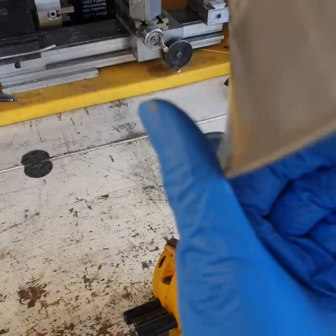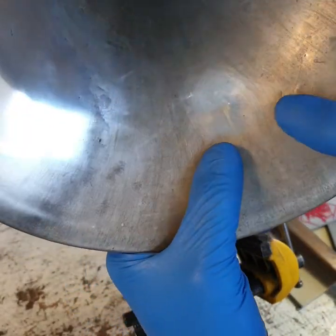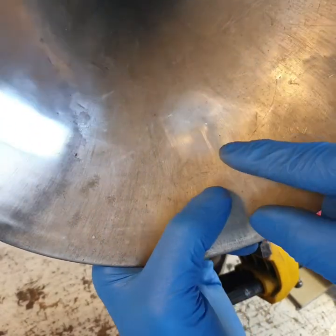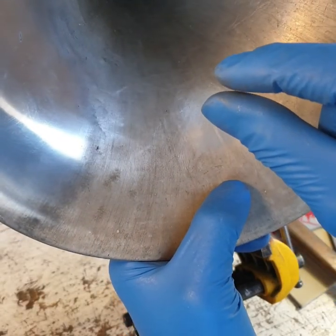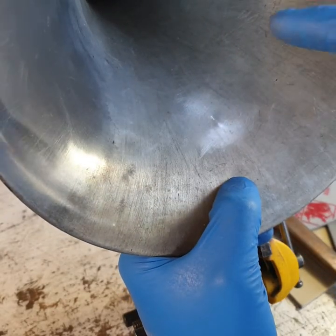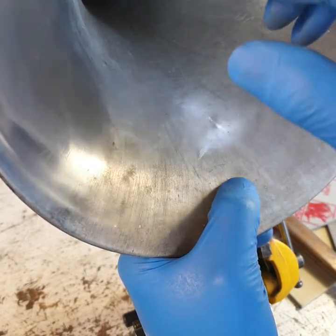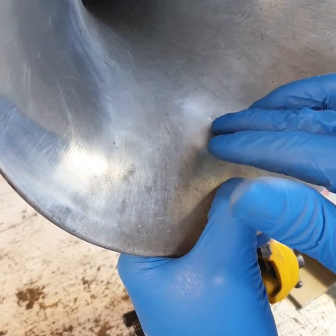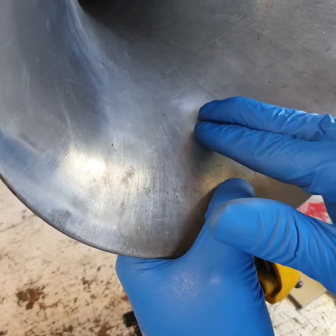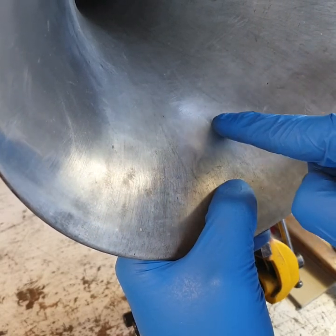So let's work with very soft tools, because if you hammer aluminium, you are going to stretch it, and if you stretch it, then you will have a bigger bulge here, and it makes the aluminium much thinner, and then you are in big trouble. Because if you are working with steel, you can contract it by heating and then cooling it, and well, it's not that easy, but it can be made. But aluminium is another beast. Aluminium, you cannot shrink it. So you have to be very, very careful not to hammer it, just using very gentle forces